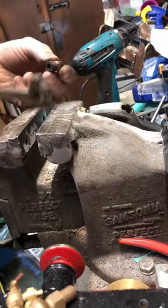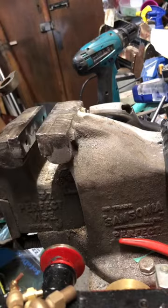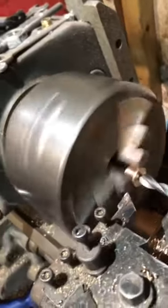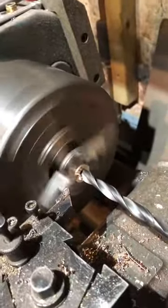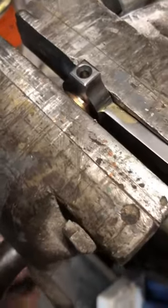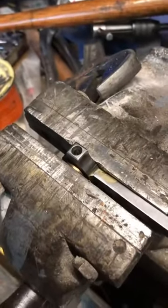The hole that's left here is about half inch, so I'll turn a new piece out of phosphor bronze that's about 2 thou big, so it squeezes in nice and tight. I use a centre drill and a twist drill that's one size down from what I need it to be, and then press that bearing in, which is a really satisfying moment.